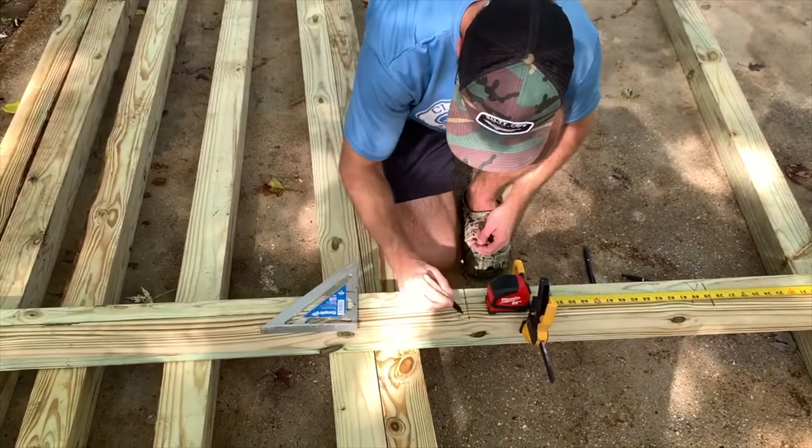So because I'm kind of lazy when it comes to pre-measuring, I would rather just hang a full sheet of plywood where it's gonna actually be installed with bar clamps, so I can temporarily hold it in place while I mark the cutouts for the windows, all three right there, and then the door's rough opening. Then we went on the outside, we removed the temporary bar clamps, pulled that sheet down, and then we're just gonna cut out all of the window and door penetrations.